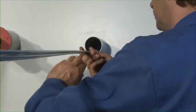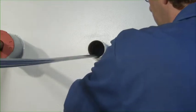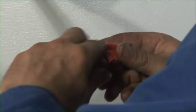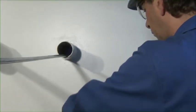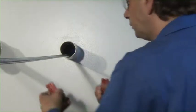First, the inner side of the conduit should be lubricated thoroughly with CSD lubricant along a distance that approximately corresponds with the length of the SLIPSIL multi-plug. Next, all parts of the plug are lubricated on the inner and outer side, including the connecting surfaces. Always use sufficient lubricant. This eases the installation significantly and helps realize optimum tightness.